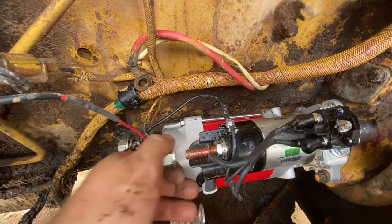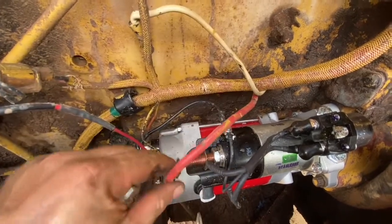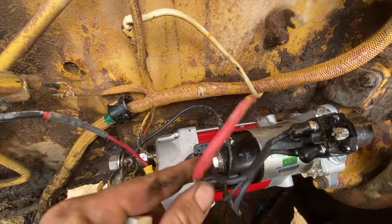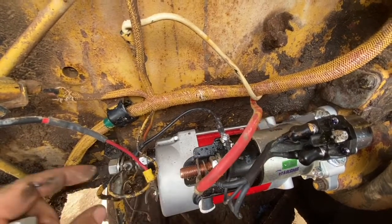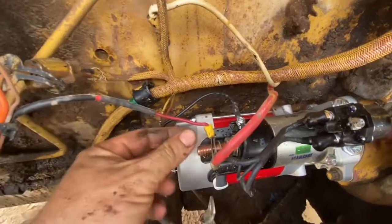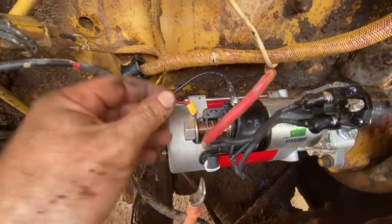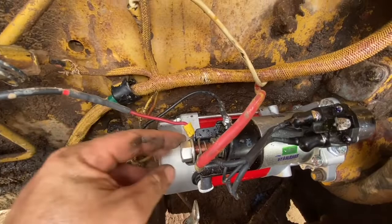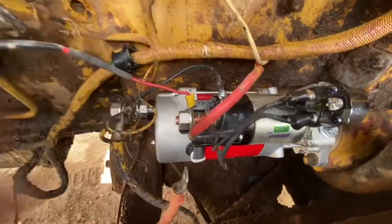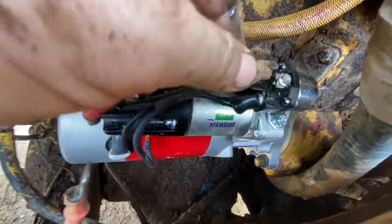This is the positive side now. This is from the alternator — so this is the charging wire — and then this is a little accessory that's been put on there. I've forgotten to put the actual main battery power cable on, which I will do in a second. And this white cable here is the signal to start the starter motor.